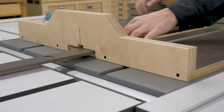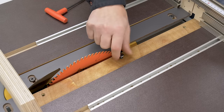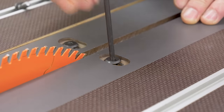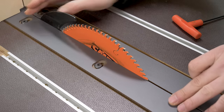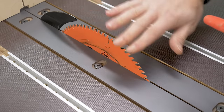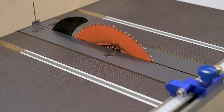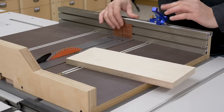I can remove them from the back of the table by taking out the screws. To adjust them, it's best to raise the blade as much as possible and tighten the screws, leaving 2 tenths of a millimeter between the insert and the teeth of the blade. It's normal for the blades in these kinds of table saws to vibrate a little when starting or stopping the motor. Here you can see how the blade removes some material from the inserts on startup. I've installed a soft start module in this saw, and even though it's improved, I haven't been able to solve it completely.